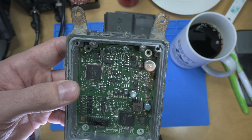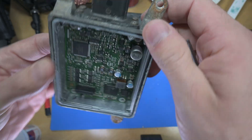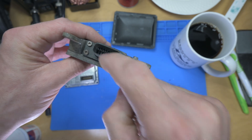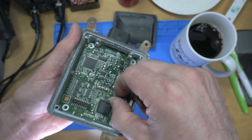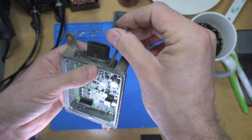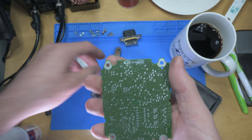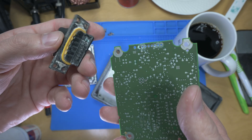So this is a neat design — and by neat I mean horrendous to figure out without having done this before. This connector here: I made the mistake of pulling it out first, or trying to, and I bent all of these pins. I had to take these little screws and put this whole thing into a sandblaster. I taped off the end so I wouldn't get sand in all the connectors, but I had to clean out my little bolts. And realistically I didn't have to do that because this just pops off. You can see all the corrosion on the inside here, and that translated to corrosion buildup on the board and corrosion buildup at this pin.